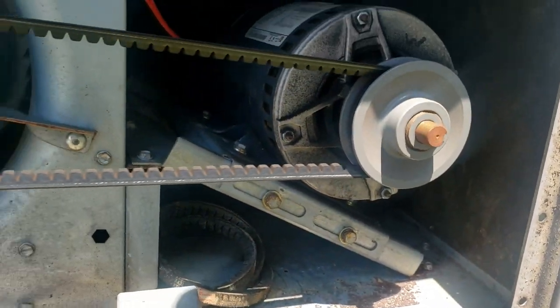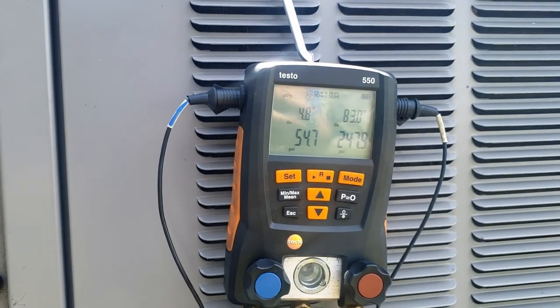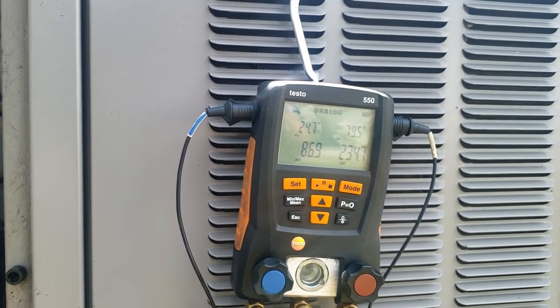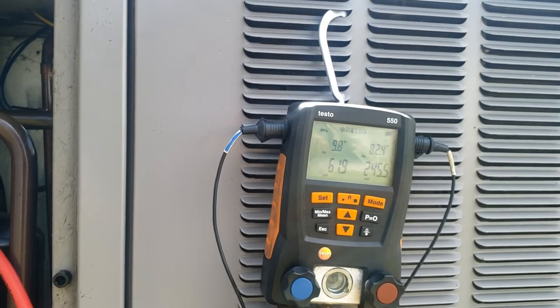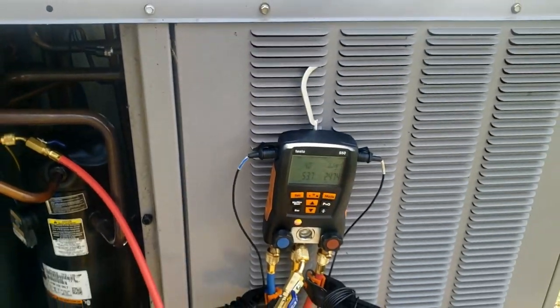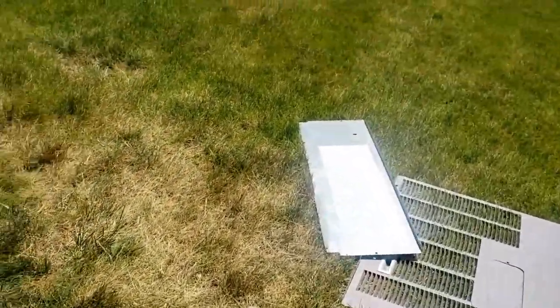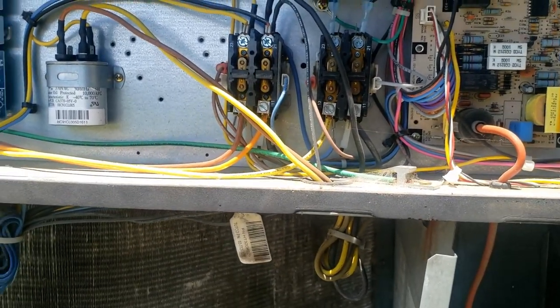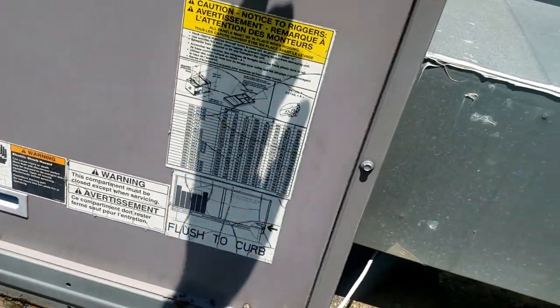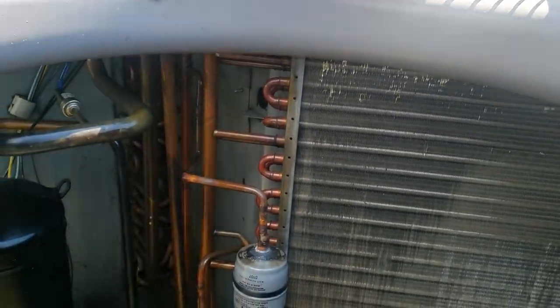Got that tightened up, it's a lot better than it was. It looks pretty well aligned so it should be good enough. She's going off on the low pressure switch, comes back on and goes again. About 82-degree discharge. Let's do some scanning and see what's going on. That contactor's toasty. This is probably 480 — yep, 460, same difference. This might actually be a good one for the ultrasonic to make it a little quicker.